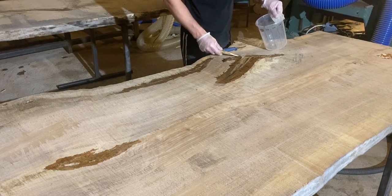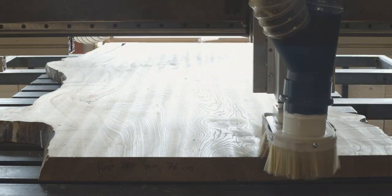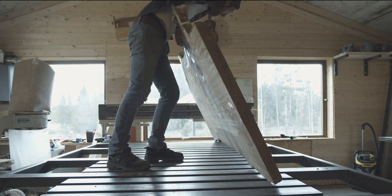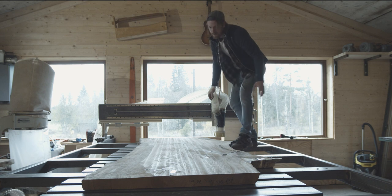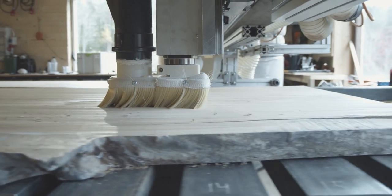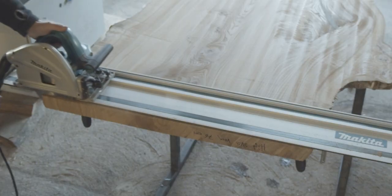Let me give you a few observations. Firstly, the wood needs to be properly dried. A few percent here or there might not be the end of the world, but if it still has a ways to go it will most likely cup and or twist as it continues to dry. Even if your wood is perfectly dry, you're probably familiar with cross-cutting a piece of wood and getting about halfway in and all of a sudden the kerf closes and your saw gets stuck. This is because of tension in the wood, and the same thing can happen when you run a piece through a planer — the tension can make the wood cup almost right after you finish planing. This doesn't happen to all pieces, but getting those C-channels installed right away can avoid any potential problems.